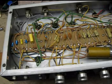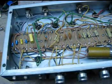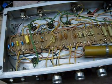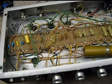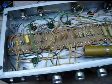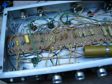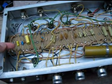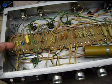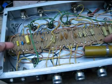Generally speaking, just changing one cap in an amp is not going to make a huge difference to the tone of it, so you don't have to go too crazy. You do want to make sure the value of the cap is a 400 volt rating, and that's about it. So we've only changed that one interstage cap between the first and second gain stage to roll out some bottom, and over here we have removed a cap presetting the presence to wide open.